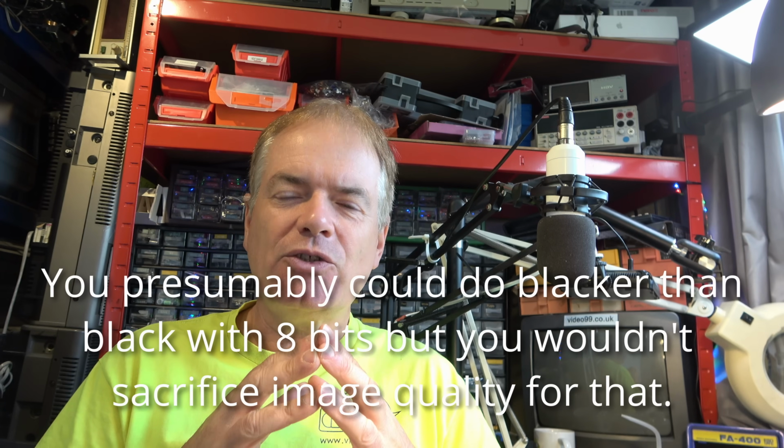So an image of a test card, this is something quite important I want to get across. An image of a test card, say recorded on a DVD, is not a test card. It will be okay for some things, but you won't be able to get access to that blacker than black and also other features that are used for testing the color decoder circuitry, because it's already been decoded on that image. There's a feature where they put in anti-PAL, which is a deliberate phase error on the test card. And it's transmitted that way, and if your PAL decoder is working properly in your receiver, it decodes it, corrects it, and gives you grey. But of course, just an image of grey is not the same as the real PAL decoder test.